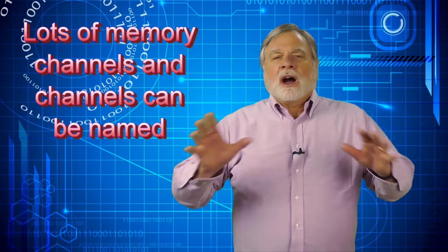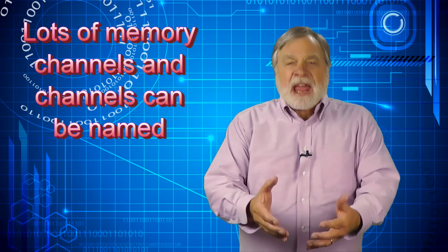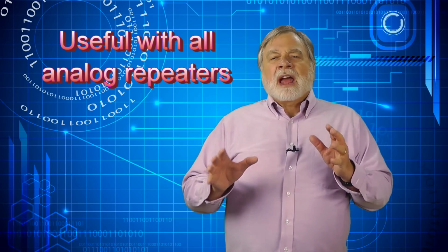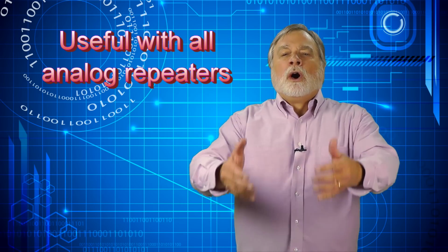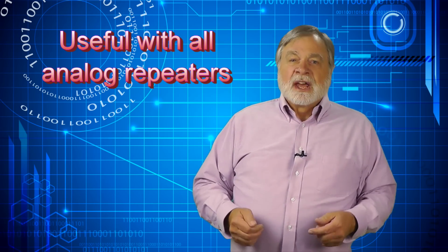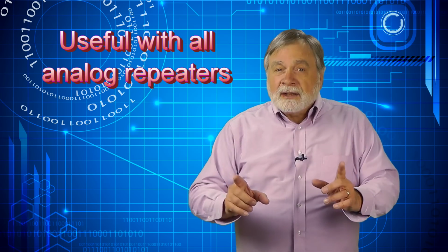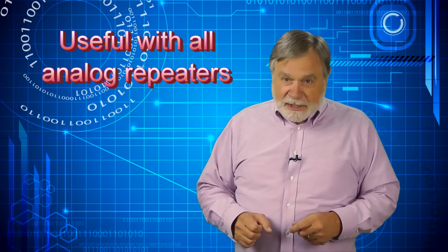The radio has gobs of memory channels, and you can give channels names. For example, the nearest repeater to me is atop a hill called Flat Top. The radio is dual watch, meaning that it can listen to 2 different frequencies at the same time, and you can hear a station coming in on either frequency, though admittedly, if you are hearing someone on one frequency, the other is momentarily blocked. The radio has all the features needed to use repeaters on both 2 meters and 70 centimeters, and it is indeed possible to set repeaters in memory using the keypad, though frankly, you'll be happier doing it via the programming software.